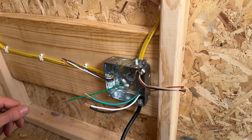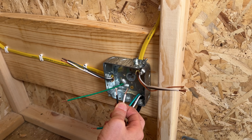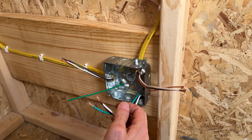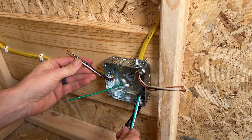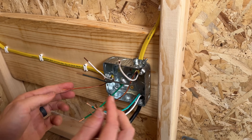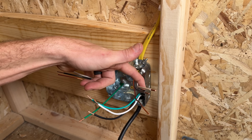Now we're back at the junction box that we first installed. A power cord is coming in here — this is how I'm going to power the shed — providing the hot and neutral out to the line side of the GFCI. I want to include as much as I can in this interior box rather than the exterior junction box, because that one with the GFCI installed really doesn't have much room. So I'll be extending these out, bringing this ground together with the rest of the grounds, combining the hots on the two circuits, the neutrals on the two circuits, and then passing the hot and neutral out to the load side of the GFCI. We'll have five wires going out to the GFCI, and that load coming back in will provide GFCI protection to our light circuit and our outlets.